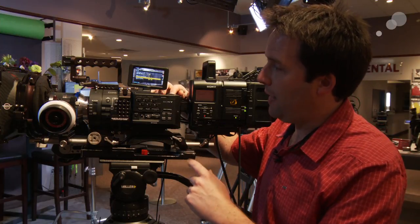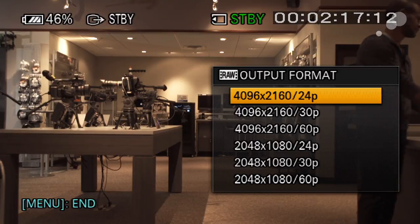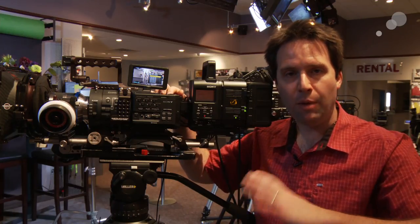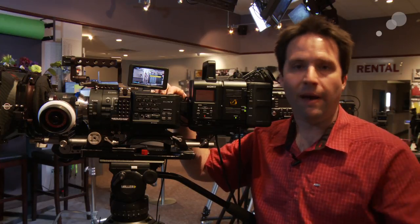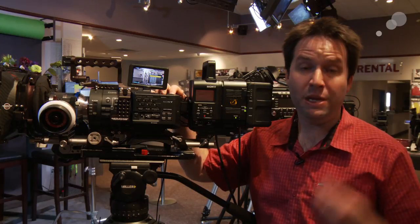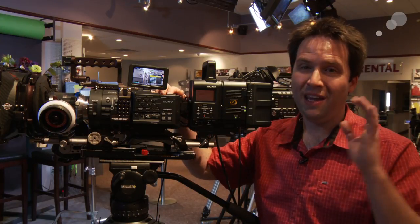The output I can choose between 4K up to 24 up to 60p, or I can do 2K from 24 up to 60p as well. If I was in PAL mode, 50 hertz mode, 25 to 50 — same kind of thing. This is great though — it means I can do up to 60p continuous frames in 4K or 2K up to 60p in this mode.